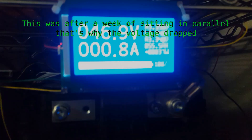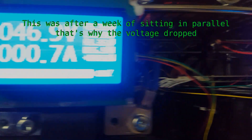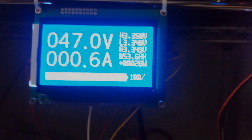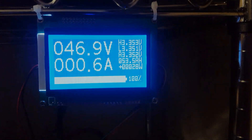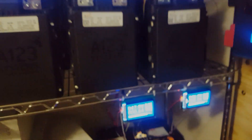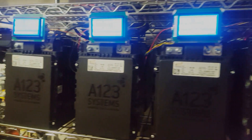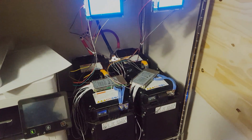I'm turning on the charger and we should see wattage going into every one of these now. The top five have power going in, and then the bottom two new strings are showing 28 watts and 28 watts each. Everything is now in parallel — we'll let this get up to a higher state of charge. These two strings are successfully paralleled in.